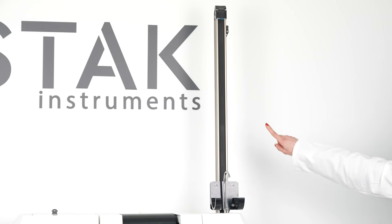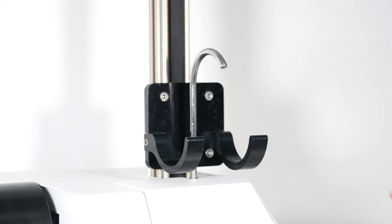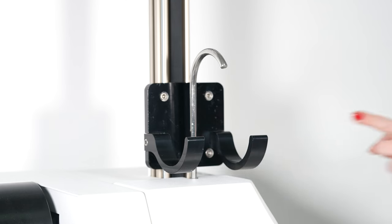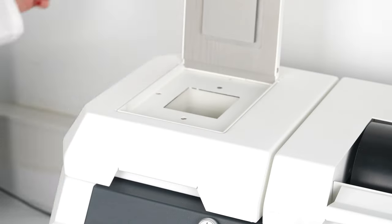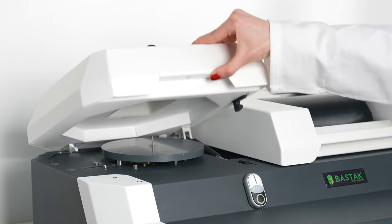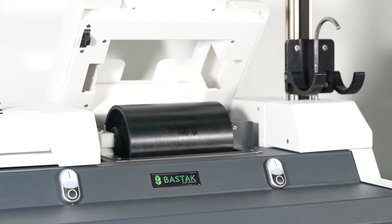The Linear Tower, with its moving mechanism, stretches the dough in the direction against gravity. The Dough Holding Slot is the section where the dough holding device is placed. The Stretching Hook is the metal part allowing the dough to be stretched by grabbing it from the middle. The Dough Rounding Unit gives the dough its standard round shape, and the Dough Cylindering Unit gives the dough a standard cylinder shape.